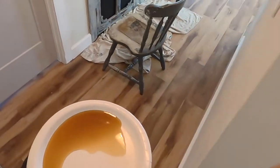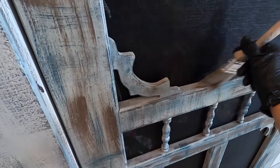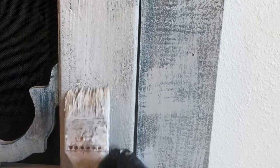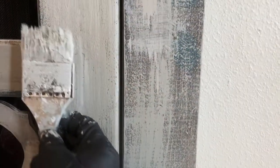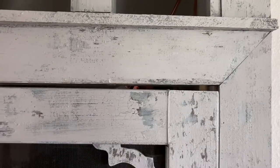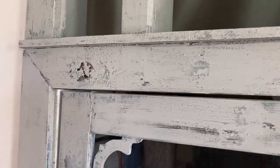I love the cracked patina product because it transforms the surface into something beautifully distressed and cracked — it was that missing layer of texture and depth I needed. I applied it like paint once the brown and teal colors were dry, let it dry, then came back over with a little bit of the gray paint just enough to get the crackling effect. With my brush I went parallel over the surface and tapped over the painted areas, which peeled off some of the paint. I did this all over the frame of the door, giving everything an aged, distressed look. Look at the final results — I just love how this door came out and it now embodies that vision of more character and age.